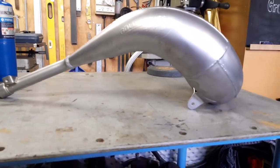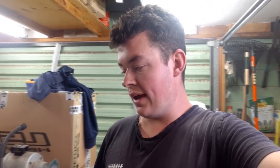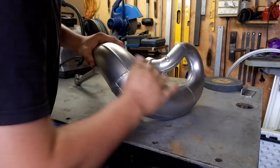It's been vapor blasted for about a week now and we haven't sprayed any lubricant on it to stop it from rusting, and it's only just starting to get a bit of surface rust now as you can see. So from what the pipe was originally — being all rusty — just from having it dipped and then vapor blasted, it's come up real mint. Now I'm just going to get a scotch brite pad, just a dry one, and give it a quick wipe over to clean up any rust, and then we'll break out the blow torch and heat treat these welds.